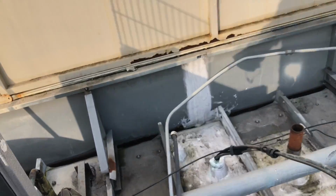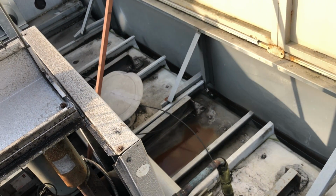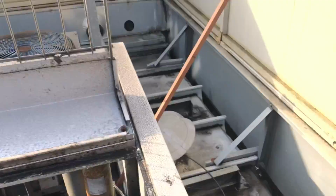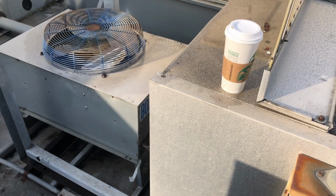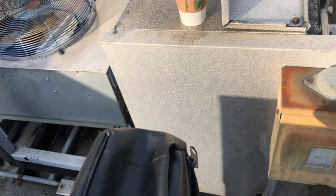It's 7/8 inch. I'll get an expansion valve for the coil, and we'll switch this from R22 over to 404. And that's a single phase unit. That's what I'm going to work on. We'll see if they like my price or not. They don't have a walk-in now, so they can't sell beers and things. And it's at the gas station. All right, that's one down. Nothing I can do on this till Monday to get some pricing, schedule the crane, all that fun stuff. Let's boogie to the next.